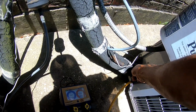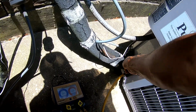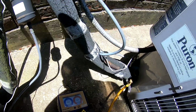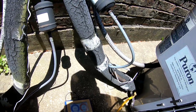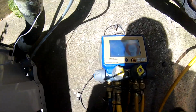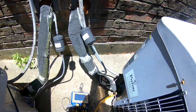So I'm gonna blame this one either on a drain line or a cracked drain pan or something. So I'm gonna go up there and vacuum out the emergency drain pan and try to flush out the primary drain pan, because I'm thinking we just got a clog right now. All right. So like I say, we're both above freezing on both of these units, upstairs and downstairs.